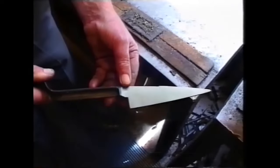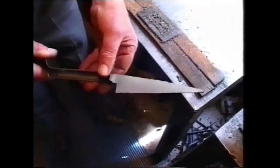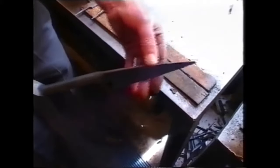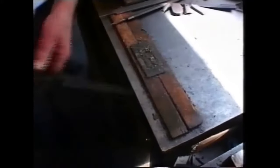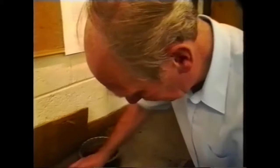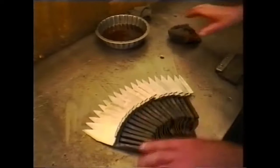Have a quick look down the blade, see the quality's there. The blade hasn't moved on the jig — if it did, it would be no good because it wouldn't cut. Then have a quick look at the thickness and a quick look at the back, because if the back's too thin, we'll not get the strength in the blade. If they look okay, I'll check the other end. If they're not up to standard here, they're thrown out, because it's pointless letting them go any further. If they pass the examination, they're then oiled and stacked, ready for the next operation.